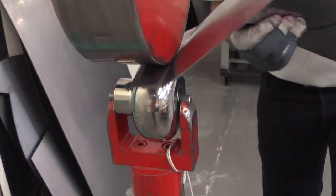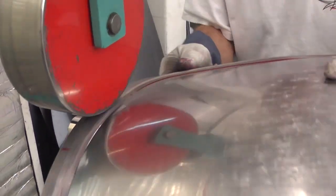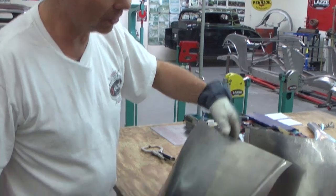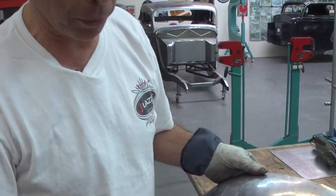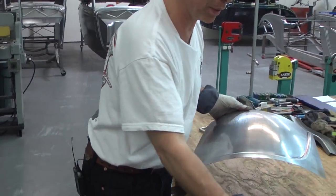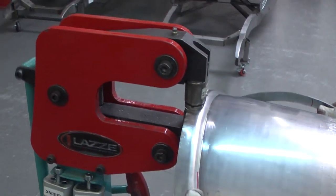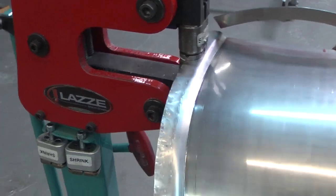And I can actually use the top wheel to bend it a little more here too. So I'm lifting up my left hand and then I can go a little further out here. I'm going to do the other one, but I think I'm going to use a different approach — I'm going to use the deep stretcher, which opens up the jaws a little more so I can go in a radius like this, then roll it and see if I can have a little better control. You see it's actually flaring out immediately now when I give it more material.